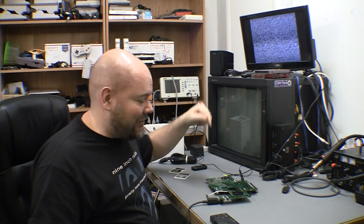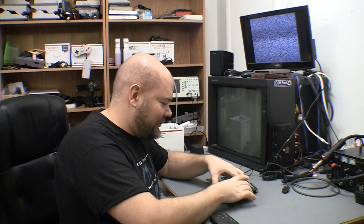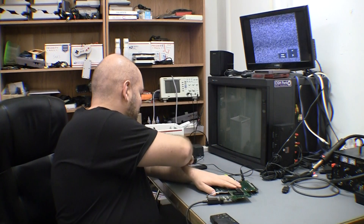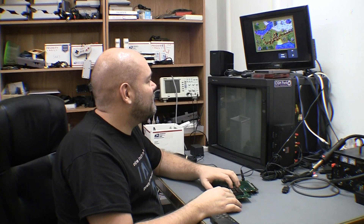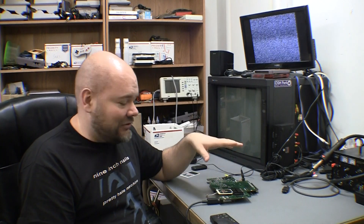It's fairly safe to test without that heatsink bolted back to the 7805, but not for long. If it just kind of mysteriously goes black or blank, it's probably because the 7805 overheated and has a thermal shutdown. We'll try a US game first. Solid screen, doesn't boot — so it could be in the wrong region. Hit the switch — there we go. Now put in a Japanese game, should also get a solid screen and no load. Turn it off, hit the switch, and we get a Japanese game loading. That's about all the testing I would do without the heatsink bolted on. Get your RF shielding back on, maybe even put it all the way back in the case, get your switch mounted, then test it again and you're probably good to go.